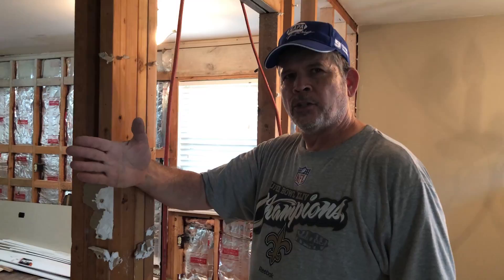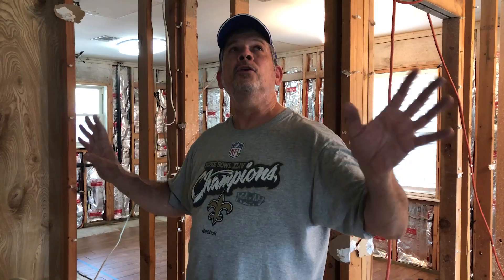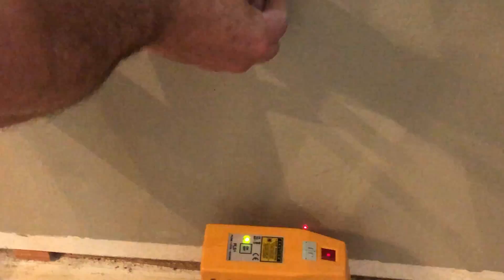The reason we're removing this drywall is because these beams are structural — they need to sit on this wall and on the post in this wall. If this was a partition wall without any beams, you could put your top plate right on the drywall. We're actually going to put the top plate on top on this side because we have a joist right here. We lucked out. See where our magnet is? We showed you that trick — that's an earth magnet stuck to the nails.